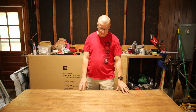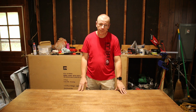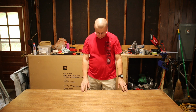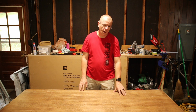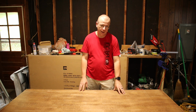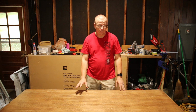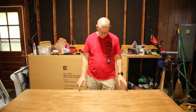So I went back and did a light sand to it, and that was with wet 400 grit. And then I used some quad zero steel wool, also wet, to try to get the rest of them. And it got most of them, but when I was wiping it off, there was actually stain coming off on the rag, which means I apparently went a little bit too deep.